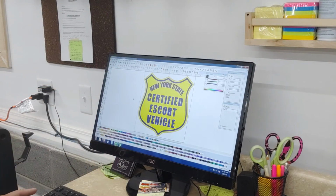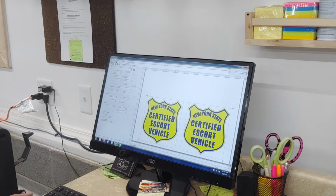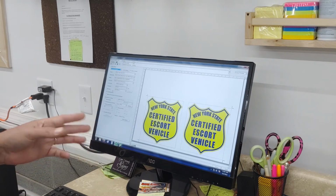This is what we're going to be doing our test prints on. It's a regular 12 by 12. It's nothing really big or fancy, but these are some normal things that we sell. For this first demonstration, I'm going to print on what I consider my high speed, which is a banner profile, 540 by 720 high speed. The print mode is custom 13, 540 by 720, so it's 6 passes. The color mode is CMYK variable dot with diffusion smooth gradients. This is all vector image, so this isn't rasterized.